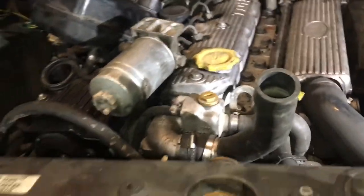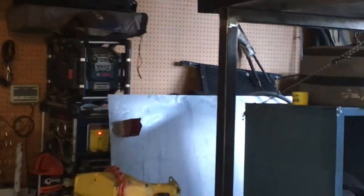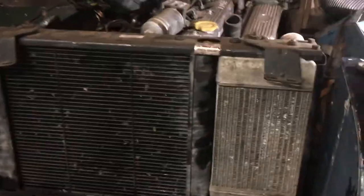We have a general location of the radiator, which is sitting under that wing — this one is just cattywampus. What this tells me: I promised you guys in the fourth video that we would decide whether to stay with the original grill or go all the way to the Defender grill. Here's my limitation — I can't come any further forward because of the manual steering. I could center this, which is how it's typically done, and stagger this just slightly in front, but then I barely have enough room for the air conditioning condenser and its fan. Right now I'm leaning toward leaving myself room and going with the Defender front end, but we'll leave that decision until I goof around a bit more.